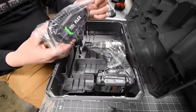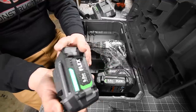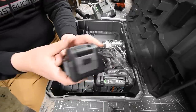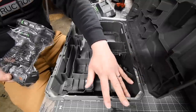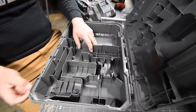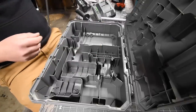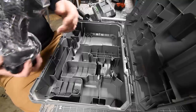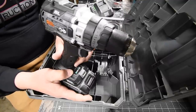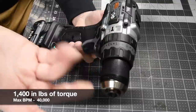I did charge these up. I love the design of the battery — the battery level indicator is awesome, on both sides. It does have a rubber molding drip on the front and back of the bottom so you don't scratch your surface. It has rubber placement so the tool doesn't go against the plastic — though that doesn't really matter if your case is already broken. This case is garbage; because of that weakness, one side won't lock so I can only use one clamp. I wish this came with a bag. There is an actual turbo button. Model number is FX1271T, 24-volt system — two speed settings: 0–550 on speed one, 0–2000 on speed two; with turbo: 0–700 on speed one and 0–2500 on speed two. 24-point clutch with separate transmission modes for drill, screw-drill, and hammer.